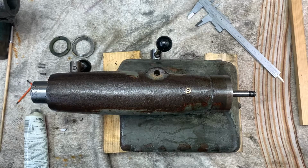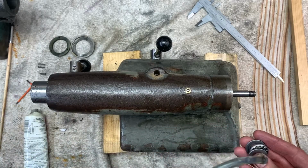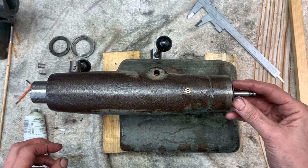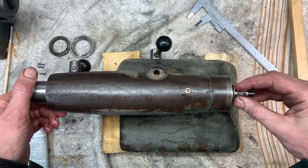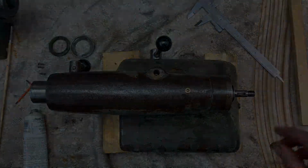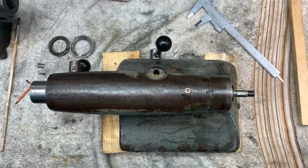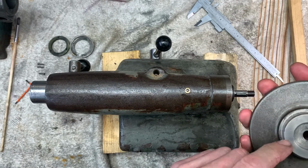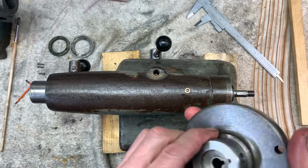So we've got to put the handle back on now. Again, I'm going to put a bit of gear on here. That's the thrust bearing from this side. There's a key on the shaft. On goes the key. I'm going to put that handle back on, the handle. We've got the key, goes over the key here.